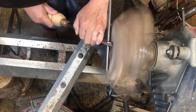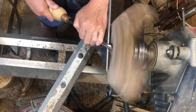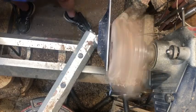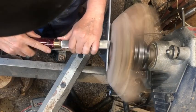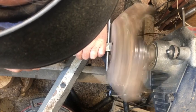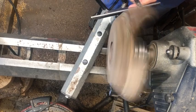That'll make it easier for me to put my maker's mark at the very end. Just taking my time there — the wood's hard, and in the center it turns a little slower. But by having my feed rate slow, I can get a nice smooth cut. Using my skew on its side just to clean up that outer edge so that my chuck jaws can get a good grasp on that recess.